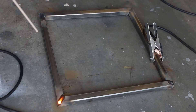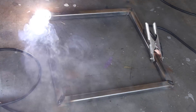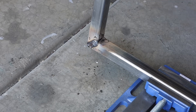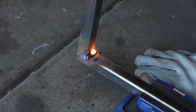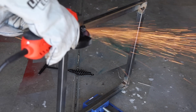I've switched over to 7018 to run these welds and it's going pretty well, but this machine feels just a little sluggish to get started. For $60, it'll stick stuff together — that's pretty cool — but it's not as good as a more expensive machine. Before the next weld, I chip off a little slag with the chipping hammer and brush it with the wire brush that came with the machine. Then I weld the inside corner joint, switch to a grinding wheel, and flatten everything out.